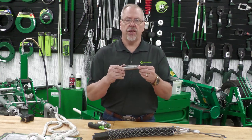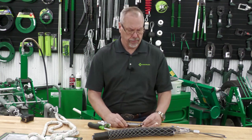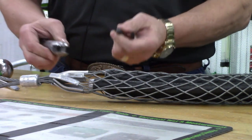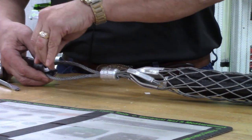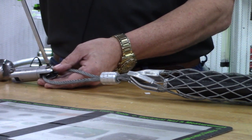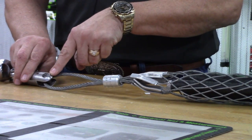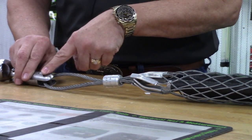You'll notice that there are two bolts in each end of that swivel, so that I can hook the grip to it and also a rope-to-swivel connector. The grip is easily connected to the swivel by taking that screw shoulder bolt out, putting the eyelet of the grip into the swivel, putting the screw back in, and tightening it up. That thread is not going to see the strength of the cable pull — it needs to be snug so it doesn't fall out, but it's not going to see 5,000 pounds of force on those threads.